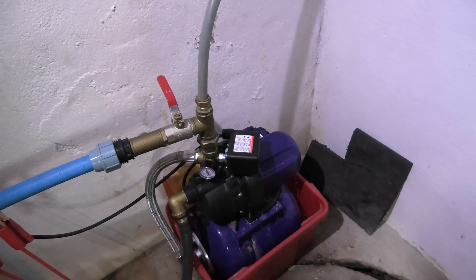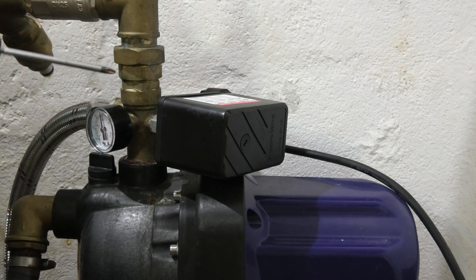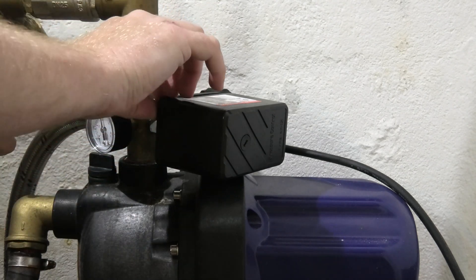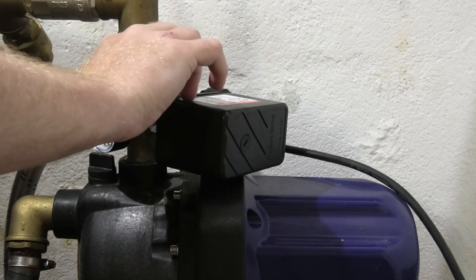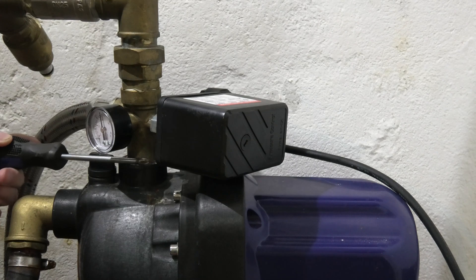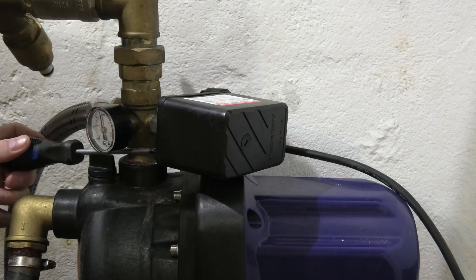If I'm doing my washing for hours the well will overflow, so we need to take this apart and clean it out and it should be good to go again. This thing is a pressure regulator. To take it off, mine has four screws on the back. I did try to undo it but it doesn't come off like that. Now we're going to unscrew this — there are some tiny little screws that I'm very much afraid to drop into the well because then they're gone forever. I might want the pressure on the pump to go down, so we'll just open this.